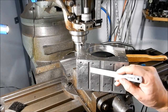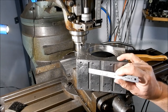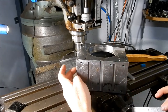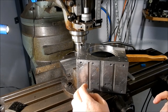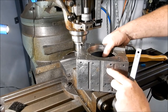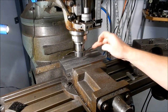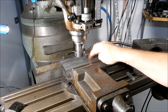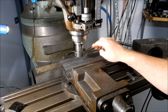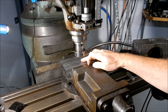The next thing I need to do is machine these 8mm keyways — these are going to register the housing against the chuck side foot base. I need to be very accurate here as I'm using that as an edge to come up against on the foot base itself. I've got to get this reasonably accurate to get that mating fit. I've left this set up from when I did the machining of the step down — I've got that between the two within 0.02 of a millimetre, so I'm happy with that.